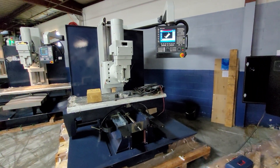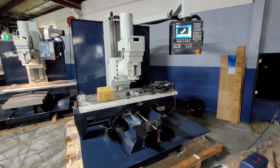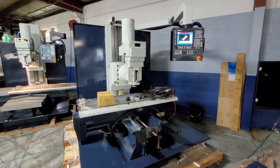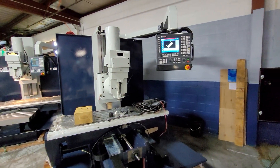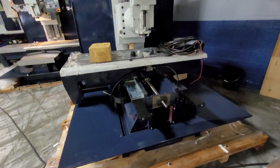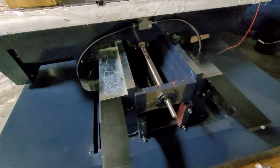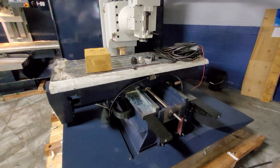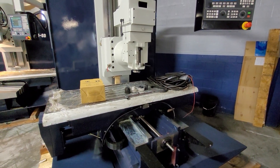This machine is our BTM50, which has 25 by 50 XY travels and well over 30 inches of max distance from spindle to table. The machine is under partial construction, which makes it a great time to view the actual build — featuring a massive ball screw and very wide, heavy solid box ways, almost uncommon these days with a lot of lightweight linear way machines.